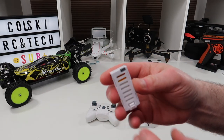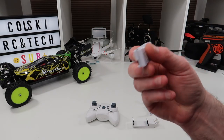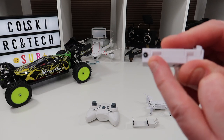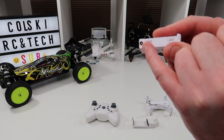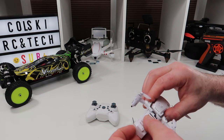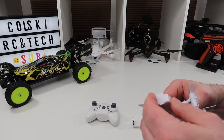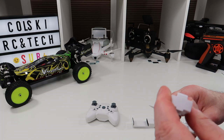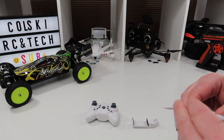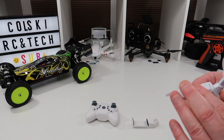I think it's 450mAh — I'll have the spec in the description below. It's a 1S battery and you charge it through that little connector there, I think it's a 3mm connector. It clips in nicely in the back and it's a good fit. I struggled to get it out, so it's nice and tight going into the drone — it's not going to come out anytime soon.